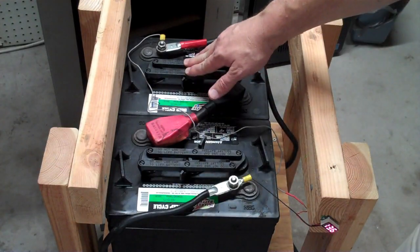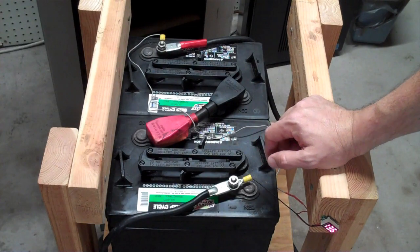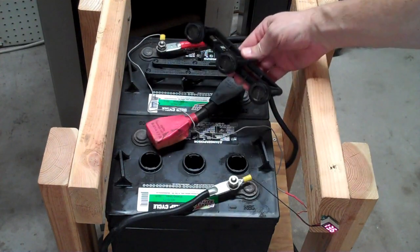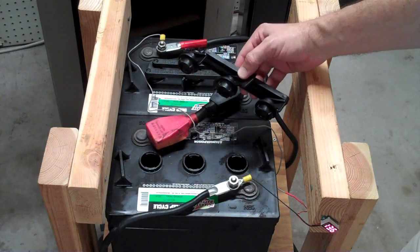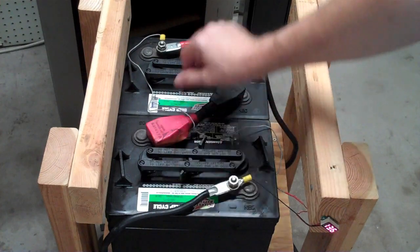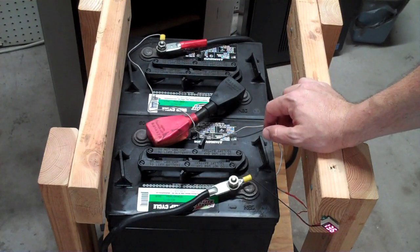But it won't power a 240-volt well pump. These 6-volt golf cart batteries are rated at a 75-amp draw to last for 107 minutes when they're new. All I have to do is every few months come in and top up these with a little bit of distilled water. Because it's in a stationary setting and I'm not drawing power out of them very frequently, it really doesn't need to be topped up too frequently.